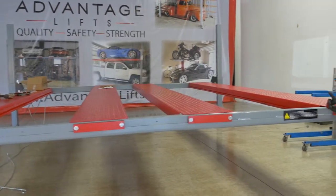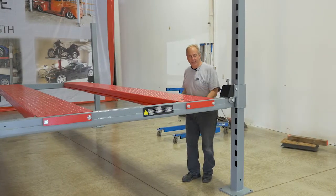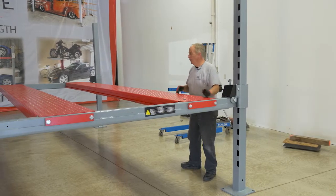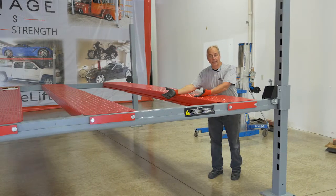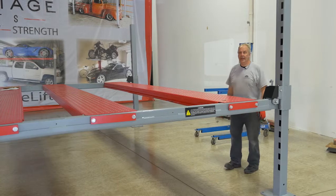But before you tighten them, one thing you want to do is make sure the tracks are completely to the outside. So you'll come to the edge and give it a yank, and make sure the track is to the outer edge of the bolt, all the way around, and even on the inside. Because if you put an aluminum deck insert in between, that gives you room for them to set down inside there. So I'll do that at this time.